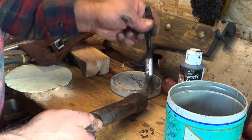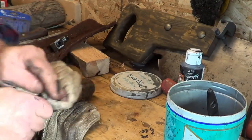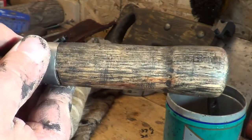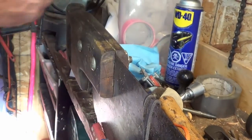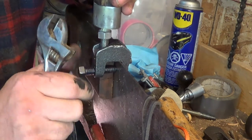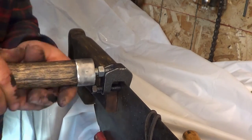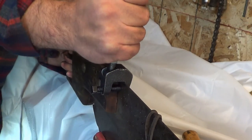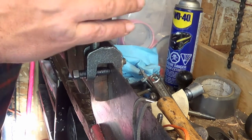So I'm going to put a little bit of oil on it. Here's the finished handle — the way this works is you put that over there, tighten up this bolt and it clamps it against the blade. Just give it a good tighten and there's your extra handle. I have it threaded on the sides as well so I have a few different options.